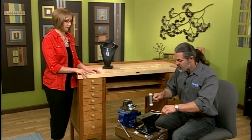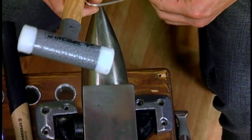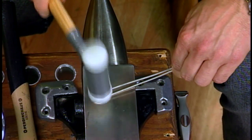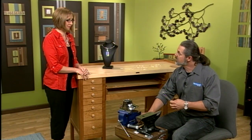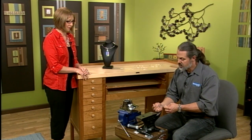For a neck ring, 18 to 22 inches in length is pretty good, and you're allowing for the fact that most neck rings don't use a clasp — it just sits right around the neck and kind of clamps on. So I'm going to bend it about this much right here and then I'm going to use a hammer to do some forging.